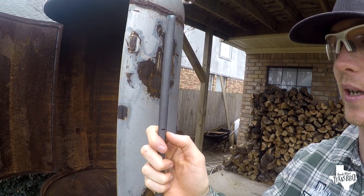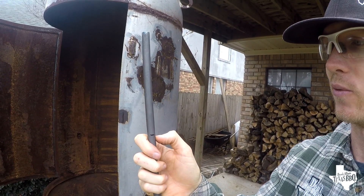What I'm gonna do is cut a V groove right here where I've got it marked, which is gonna weaken the metal, and then I'm gonna bend it by hand. It's actually really easy to bend by hand once you cut the groove in there — let me show you all how this works.